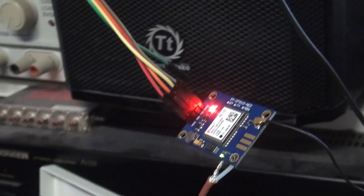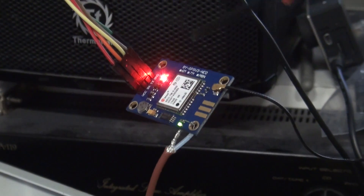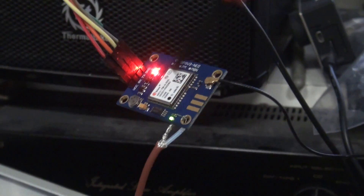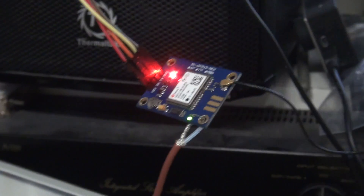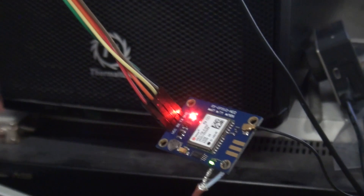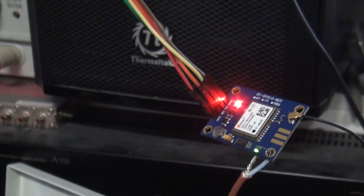Ideally if you're going to plug it into 4 or 5 things at once, you're probably best off building a small buffer amplifier, connecting it to the output, and then have 4 or 5 outputs to connect into your different bits of test equipment if everything's using, say, 10 MHz as a reference.